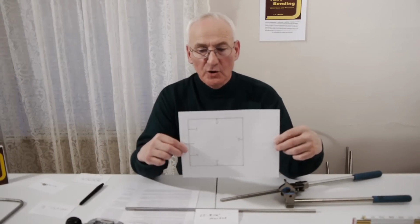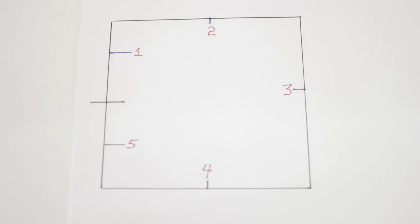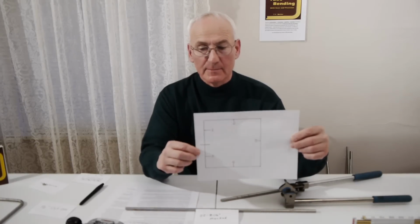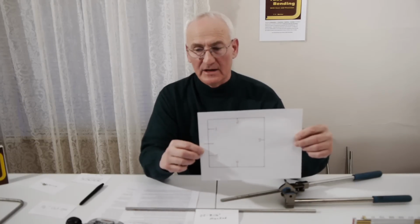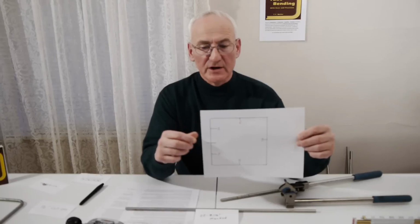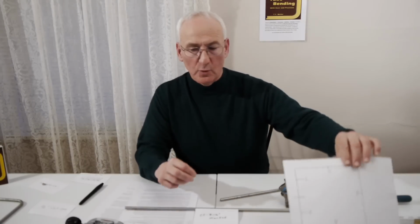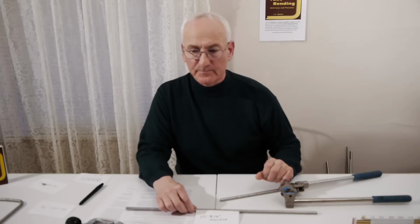and since no conduit, pipe, or tube is continuous unless it is welded, bisect one side of this square box so that you will have 5 dimensions instead of 4 dimensions. 4 sides is 4 dimensions, but since one side is being bisected, you're going to have 5 dimensions. Your sketch shows 4 each 90-degree bends. Use the tube, which was cut exactly 22 8/16 inches long.